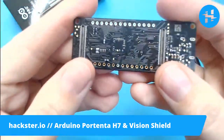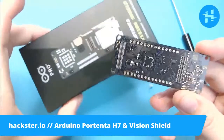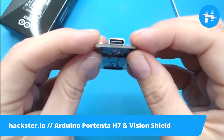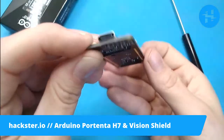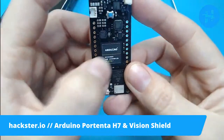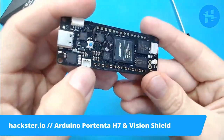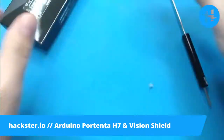On the back, what leaps out are these two 80-pin connectors. These are ridiculous — this is how you connect the two boards together, but you could also connect all kinds of other stuff for high-speed, lots of connections. That's how you get that large number of digital IO. You've got your USB-C port, which can act as a host or a client, so you can use it as DisplayPort out, for power, programming, as a USB hub, and all kinds of other stuff. Here's your STM32 chip. Reset button — classic. And then this other little connector is also interesting; we'll look at the website to figure it out.